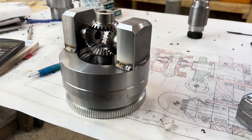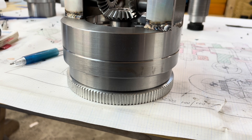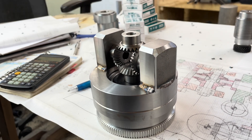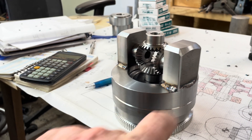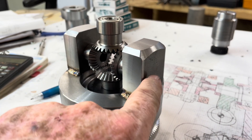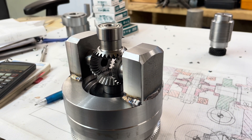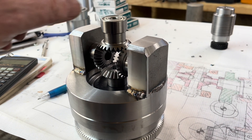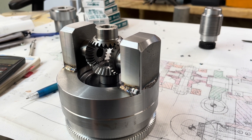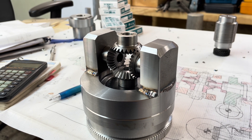This is the differential carrier assembly. It's got the bearing buried in there and the 120-tooth worm gear that's going to be the input from the lead compensation mechanism. I'm going to put a bore through there that's the right size for this double row ball bearing, then put a clamp on the outside so I can move the ball bearing back and forth for adjustment. I want to run this as close to zero lash as I can manage without binding, because this is a primary and direct input to the spindle position — particularly when cutting helical gears, part of the cutting force is going to be resolved as a moment, so I don't want there to be a lot of play.